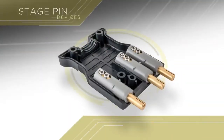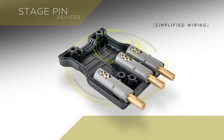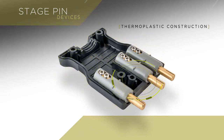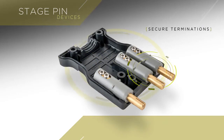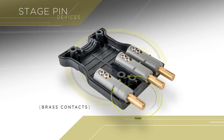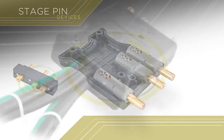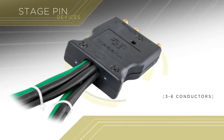Some of the unique features in our stage pin offering include built-in adjustable strain relief, simplified wiring, ergonomic design, durable thermoplastic construction, removable heat resistant sleeves, highly secure terminations, high performance brass contacts, as well as ring terminal and double set screw termination options. Additionally, a single device can accommodate three to six conductors all in one unit.